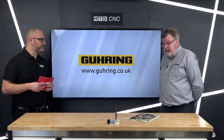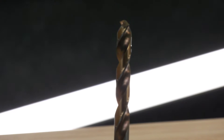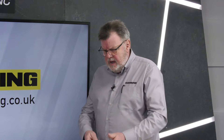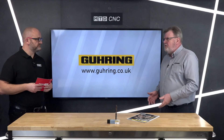What makes this different to a drill you'd put on a CNC machine? First of all, it's cobalt. The vast majority of tools nowadays are carbide, but with the growth of carbide we're now bringing back ranges of high-speed cobalt — high-speed steel type tools — for where you can't use carbide. It simply doesn't lend itself to handheld drills.